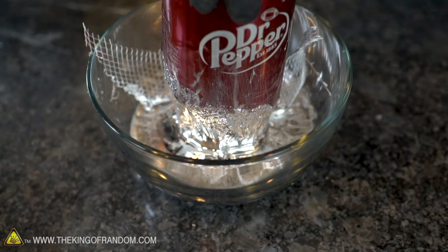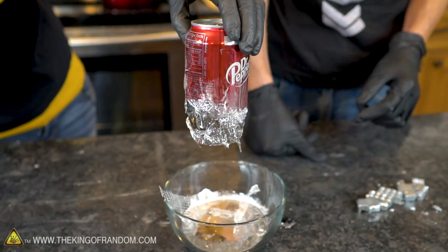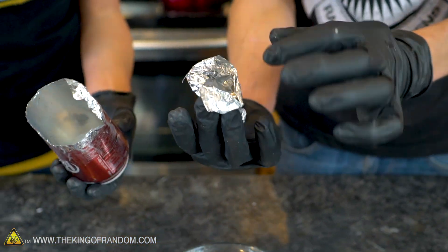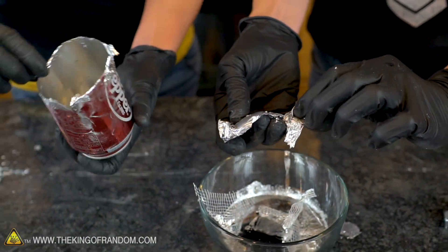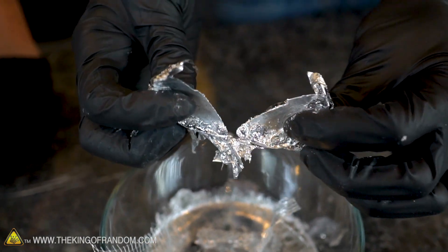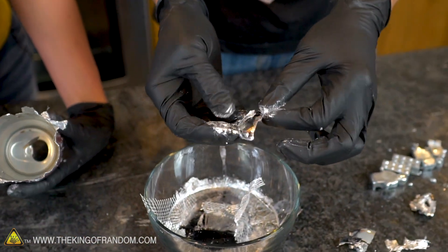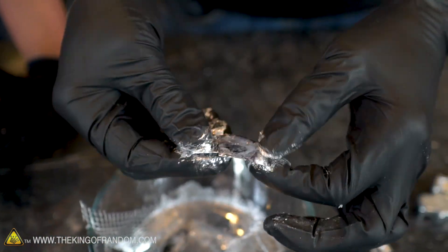I'm going to try and pick it up. The bottom just tore open when it caught on this other piece. Where that air bubble was, where we couldn't actually get the gallium, the very bottom is still fine — there was an air bubble protecting it from the gallium. So this is an aluminum can with about the structural integrity of aluminum foil, maybe less. You can see it was cracking all the way up the edges, and this is just tearing like newspaper as I touch it. What we're pulling off right now is the plastic coating on the inside of aluminum cans, which is now soaked in gallium. But this right here — this is just aluminum that soaked up gallium. It wasn't in direct contact at the bottom, but just falls to pieces.